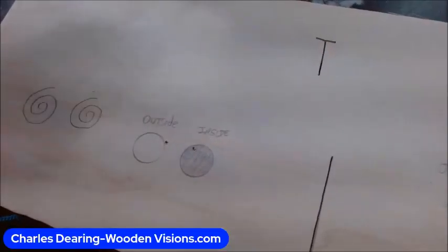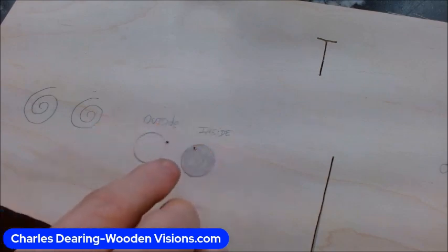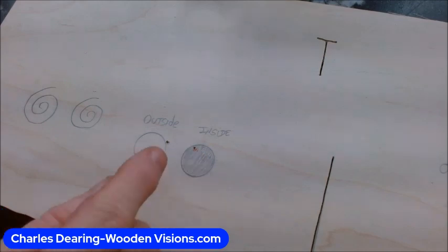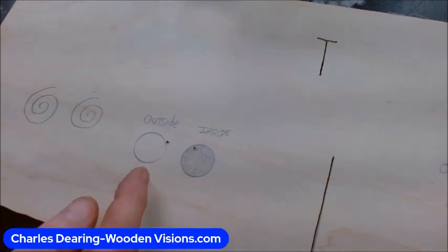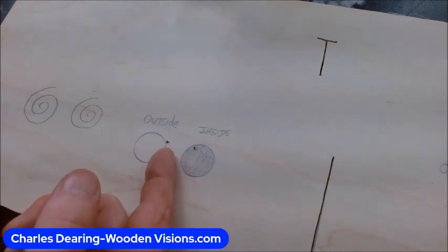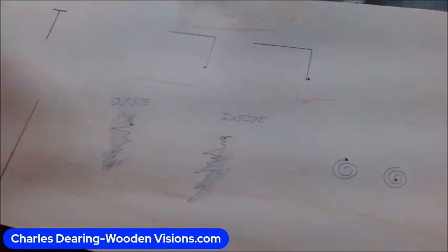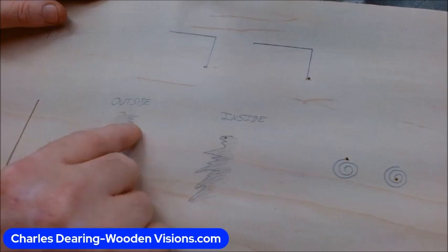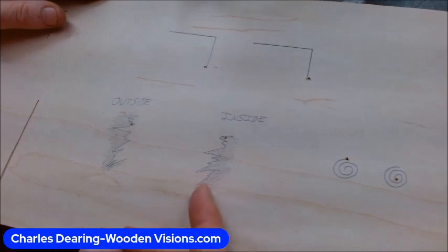Now I'm going to show you some examples of inside and outside cuts. The advantage to a spiral blade is you can use the blade as a little mini-sander. If you want to stay inside that waste area and creep up to that line to clean it up a little bit, you can get the little nubs that may be in a slightly wavy line. It's the same way on the outside — you just got to be more careful the closer you get to the part you're keeping. These right here are examples of like hair on an animal; the shaded area is the waste area.